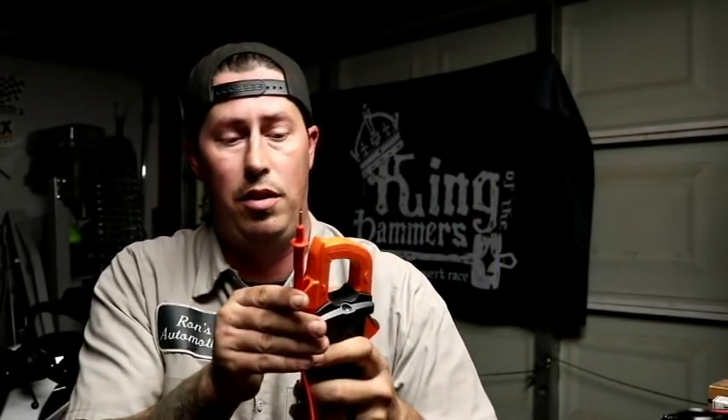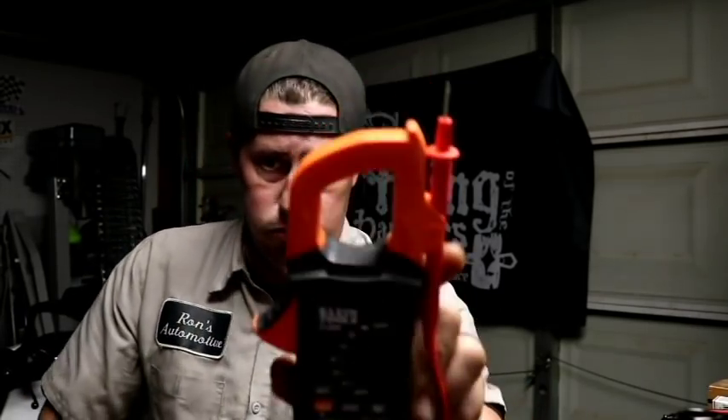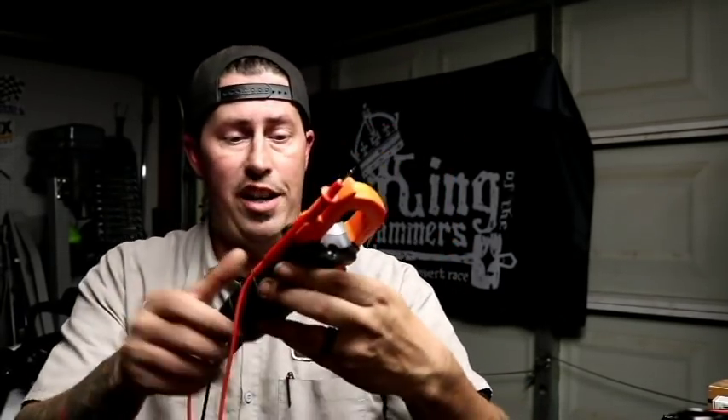Until I was able to pick one up that has true RMS — that one's for automobiles. We're going to talk about some things this house meter is lacking for automotive circuit testing. One of those things is the lead placement: they go in from the bottom, so if you drop it, it might land on the leads and crush or break them. Overall the meter's pretty tough, but it was really designed for an electrician or home handyman repair work — where you fix the common ground on one point and start testing down the panel.